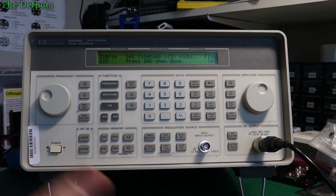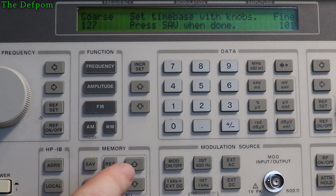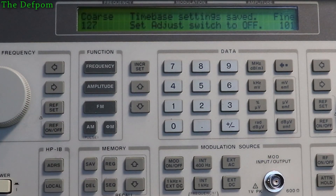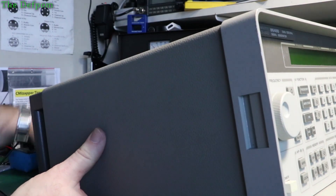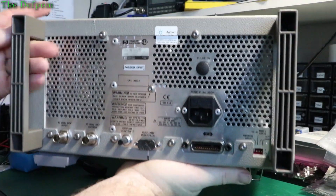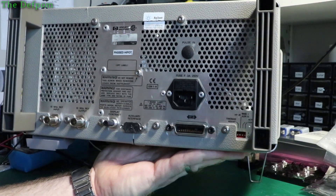If we go to 1 GHz, a 1 hertz difference could show up as 10 hertz and would be much more visible on the counter. The counter hasn't changed — still showing exactly 100 MHz. To save, I push the save button and the settings are now saved. The screen says 'Adjust time base switch to off.' According to the manual, you turn the power switch off first, then reset the switch on the back to its original position. So I'll turn it off, flip around, and put the switch back down to the off position.